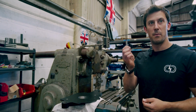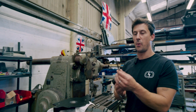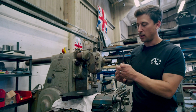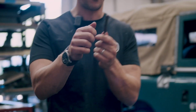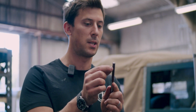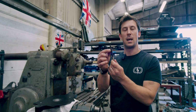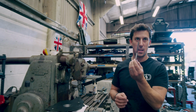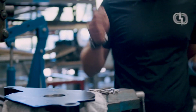And then we follow it up with the final reaming cut. A reamer is another way of cutting a hole, but rather than having spiral flutes, where a drill bit cuts predominantly with the very corner, on a reamer you've got a really accurately ground cutting face all the way up the tool, and that's what allows you to get a really accurate cut. They just come in different sizes. So this is a 10 mil reamer bit, and it works perfectly for our 10 mil dowels. And once you've got that, when it goes on, you know you're exactly in the right place.